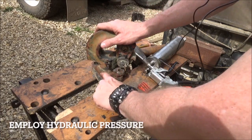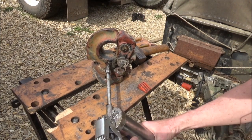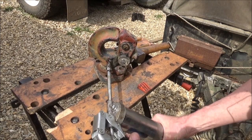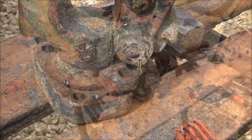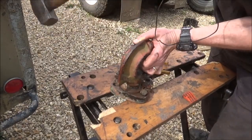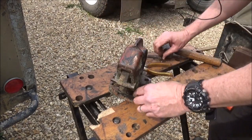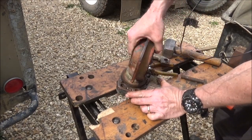This is a bit of a long shot, but because it's so badly seized it's not moving when I hit it with a hammer. So I'm going to try to do it hydraulically by filling it up with grease and see where that pushes it out. It's going to be a lot of grease. It looks like it's moving — the grease is starting to push through just there and it's definitely moving. So now I'm just going to try knocking it back up and around — look, it's loosening. I could probably just leave it, but I want to undo it. So let's get this bottom plate out.